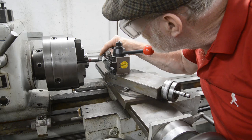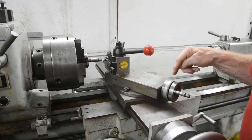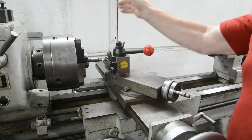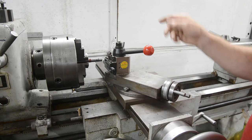So as I said, we've moved in on our compound, cross slides back to zero. Now, you would go in by little increments, and then you can measure the thread depth. There's special micrometers for measuring thread depth, so you can get little wires that go in. All that's machining type stuff. We're doing the second one on the other end, and I know that to get that end a nice fit, I went in 45 on this. So we'll go to 40, and then we'll check it with the nut. So let's get going.